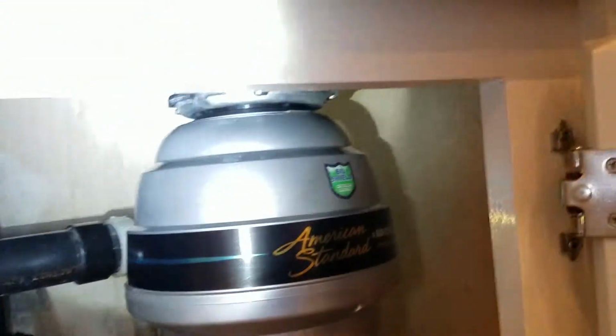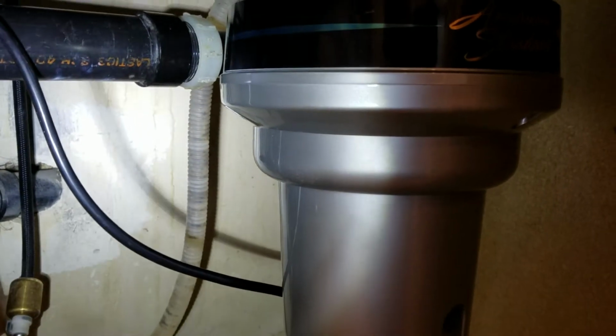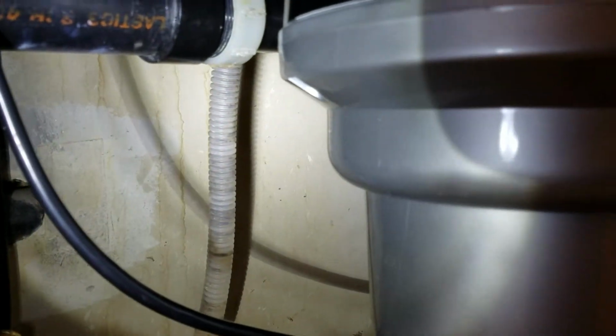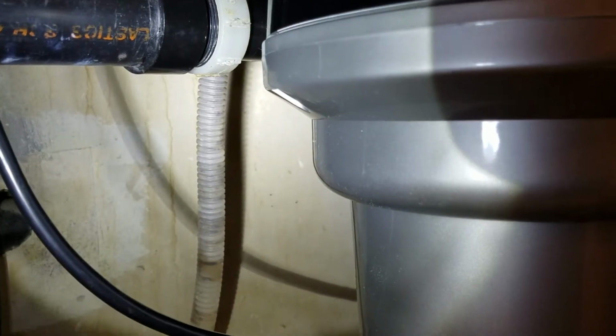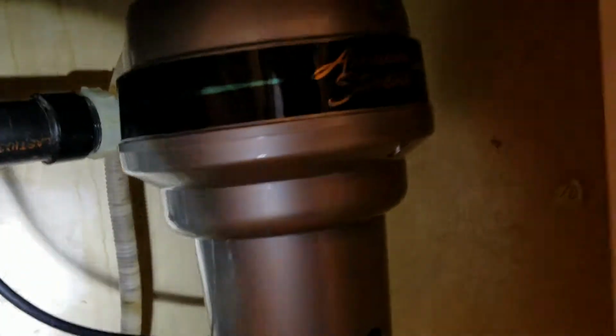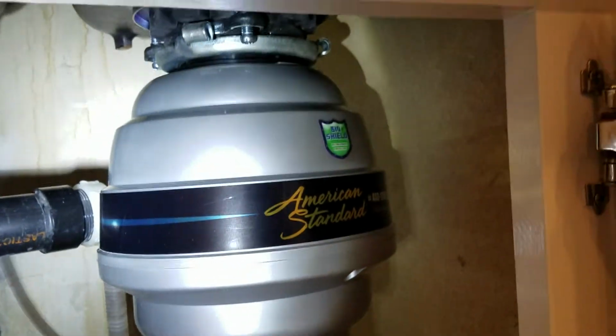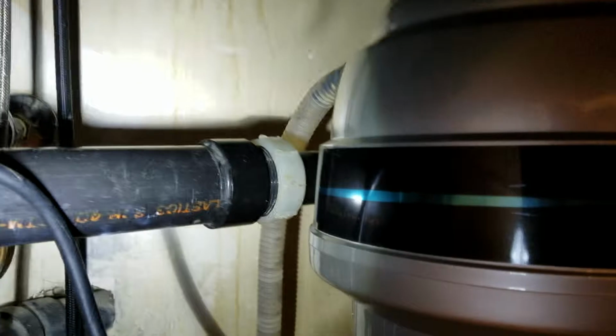and you'll have to run some water through your dishwasher just to make sure it's draining correctly. You can see some debris in the hose. So it's a corrugated hose, which comes with all dishwashers, whether they're in new installation. But the corrugation leaves little rings, little ridges, and little grooves, little valleys that food debris gets caught up in. You can see it's discolored, especially all the way up here at the top. So you have to run a load of dishes, run some water through there, make sure it's draining correctly. We've run water from up top, and we know that this drains.